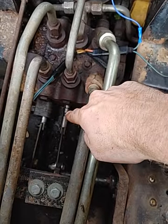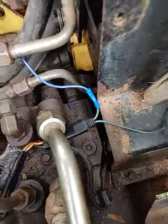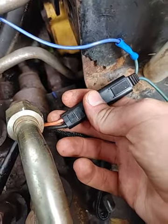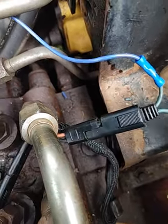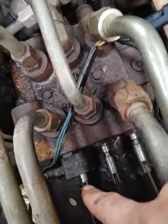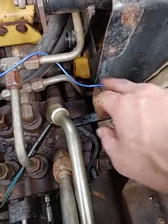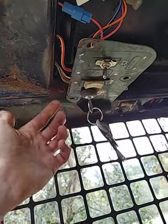It's not very clean but it gets it here. You should have two solenoids — one for the boom, which should be there (mine doesn't have it), and one for the bucket. The boom solenoid only has two wires going to it — orange and a black. Orange is your positive. If you tap into the positive side of this boom solenoid, power flows through the solenoid and back down into your bucket solenoid as well, so once power gets to this one it'll feed the other one.